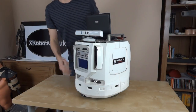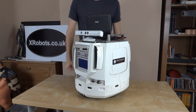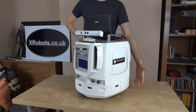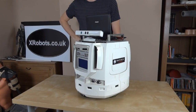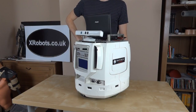The robot has sharp infrared sensors which are basically proximity sensors. They're not too bad, although they're fairly hit and miss on certain surfaces where something's reflective — like if it drives near a mirror or a big glass window. Ideally you want to mix ultrasonic sensors and infrared sensors together, or use something like an industrial laser scanner.